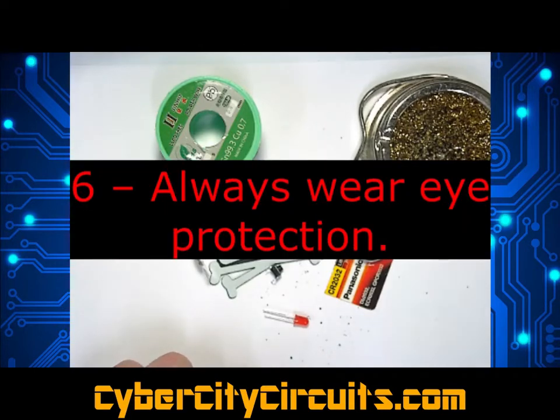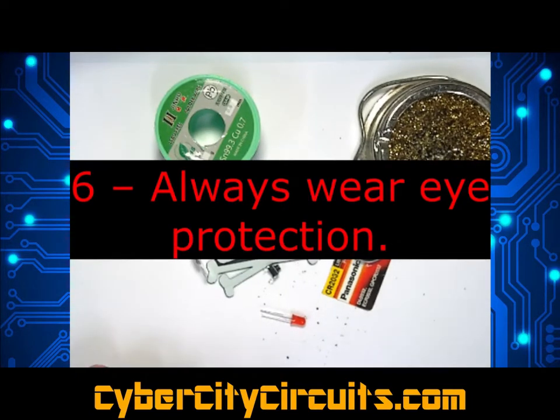Always wear eye protection. Glasses, safety glasses, goggles. Solder gets up to 400 degrees Celsius. Now, if 400 degrees Celsius solder gets in your eye, you're going to have a really bad day. You're going to end up in the hospital, and there's just going to be trouble. So always wear some sort of eye protection.